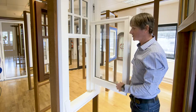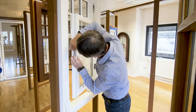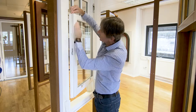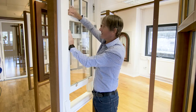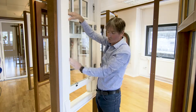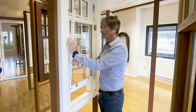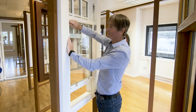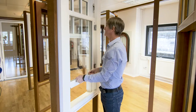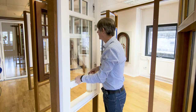To close the sash, just reverse the procedure. Make sure that the cord sits evenly inside the profile. Close the sash and pull on the cord — that will take the strain of the weight again. Next, take your baton rod and screw it back into place. Lift your sash, fold the slotted hinges back, and close the sash.